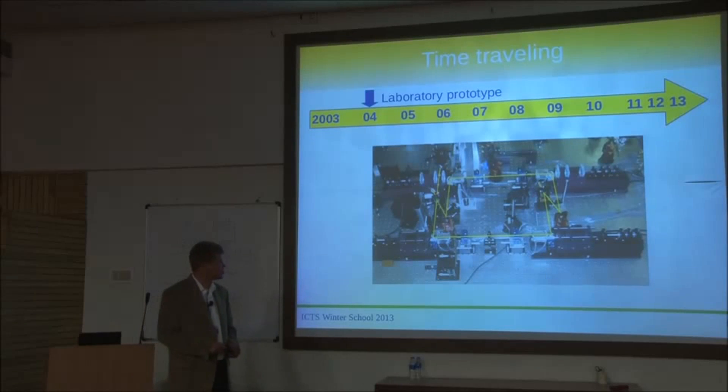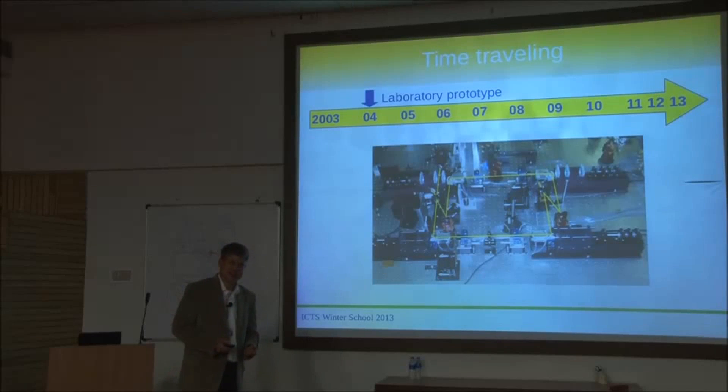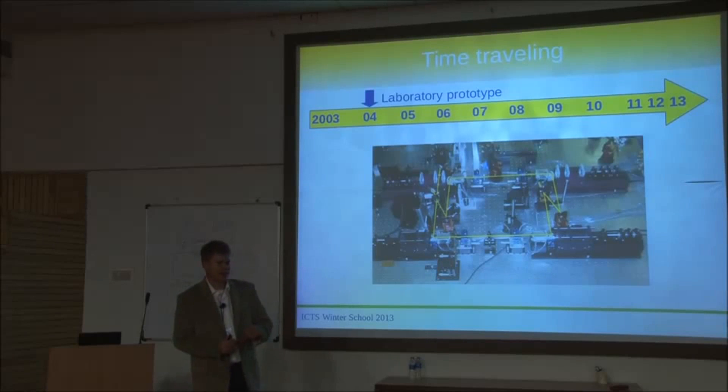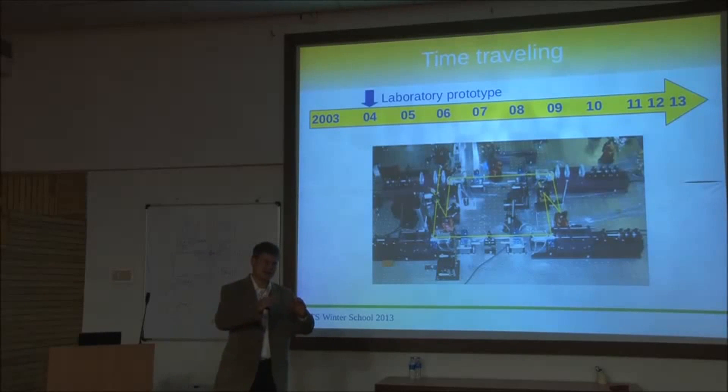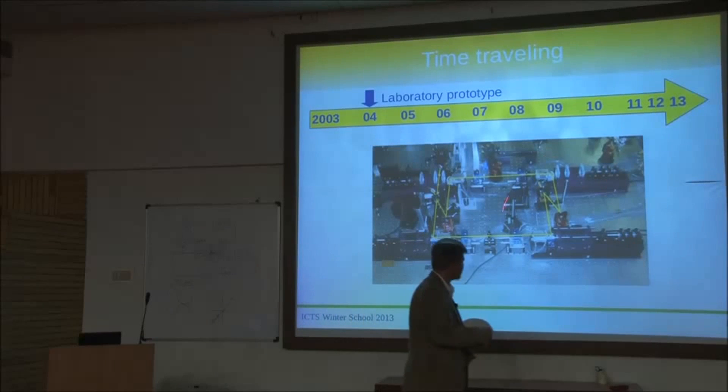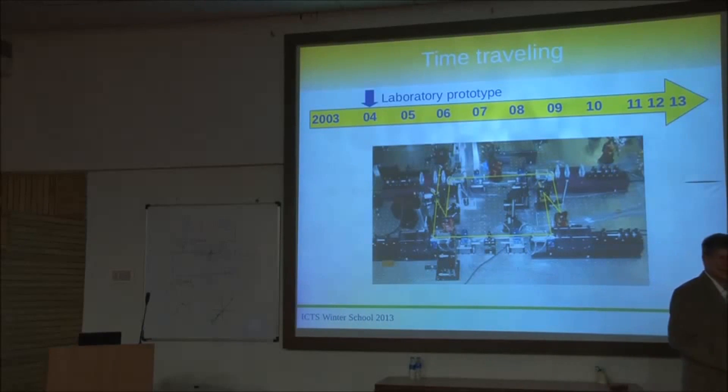At that stage, laser development wasn't that fast. The pump diodes weren't that good, so we didn't have the fiber bundle configuration with seven fibers — it was ten fibers because the pump diodes just didn't have enough power. That caused other difficulties: you can't have the densest packing of cylinders, so it was slightly asymmetric. We tried to compensate with a bigger homogenizer to make the light distribution more round. It looked a lot like a lab setup.